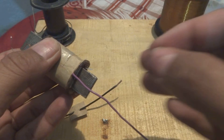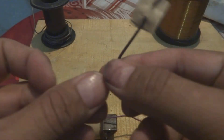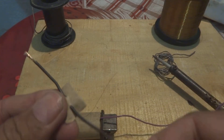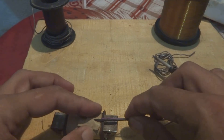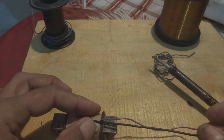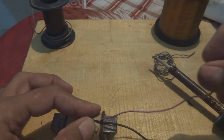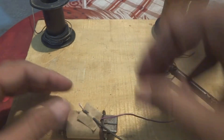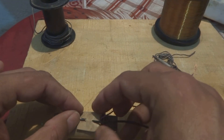By this way we are doing it like this. Now is the time to bring one lead out — as you can see, I just prepared it like this. Here is the piece of paper which I just showed you before — it will come like this. And one more lead will come out from this winding after 2000 turns. As this was 1500 turns, this will be 2000. After the 2000 turns we are going to prepare another lead.